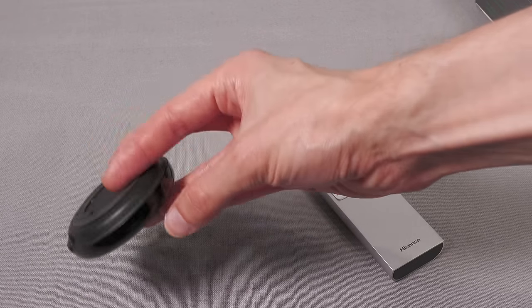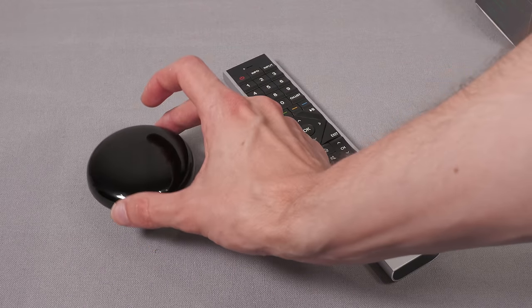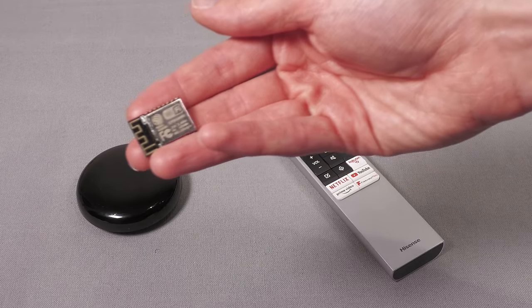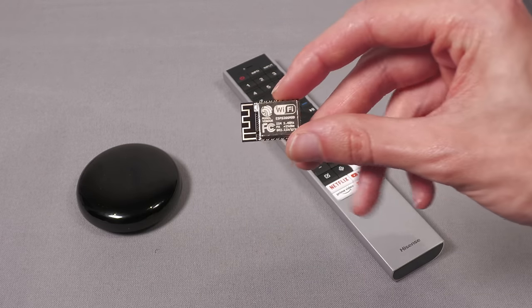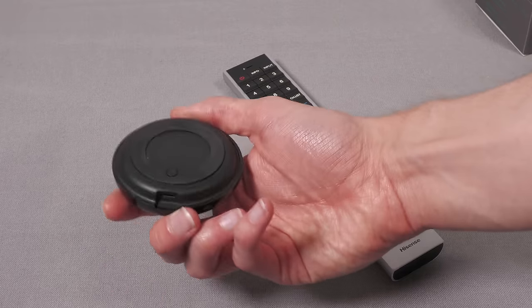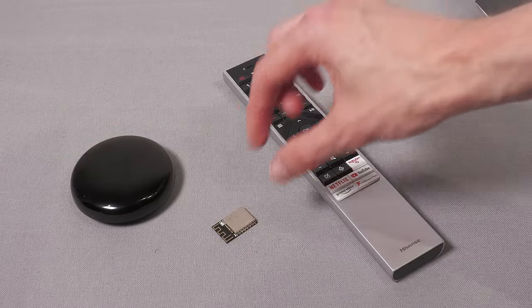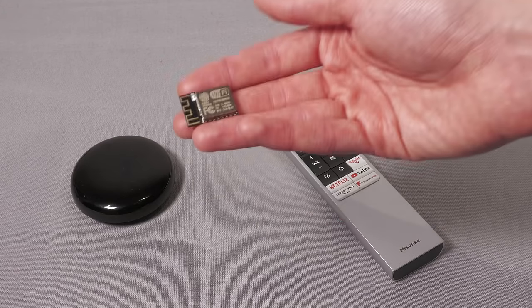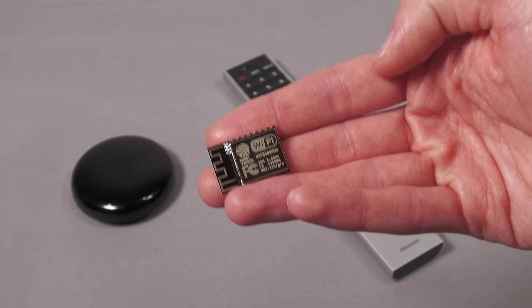Previous generations of this device you could flash Tasmota, and if you get lucky you might find one with an older chip. However this is a newer model with one of those new chips in it. So what we'll also be doing in this video is transplanting the chip - while they're fitting new chips, they're still pin-compatible with ESPs. We'll be fitting an ESP-12S, soldering that in to replace the existing chip and running Tasmota on it. This is quite a fun project, and if it works well I can see myself doing this to a lot of other Tuya devices because while it requires some soldering, you get a very nice form factor with all the casing and electronics already done for you.